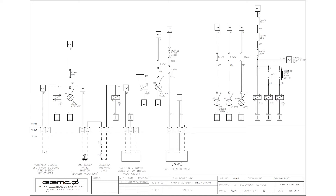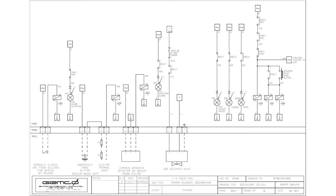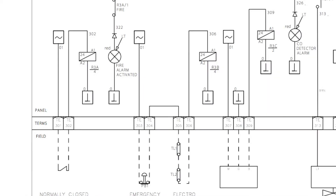The safety circuits are the gas safety circuits and the fire safety circuits that are going to allow gas into the plant room. They are made up of the building fire system, which is a normally closed contact, emergency knockoff buttons at each exit, a thermal link above each gas appliance, and potentially a gas detector in the plant room. All Jemco safety interlocks work on a very simple principle of voltage out, voltage back, to energize a relay.